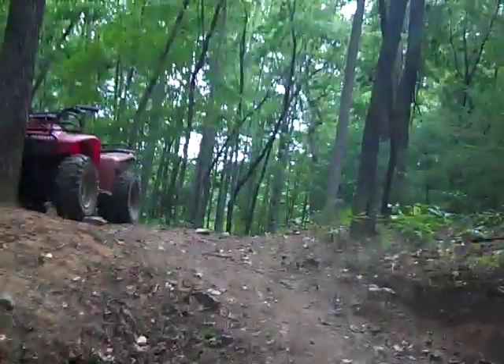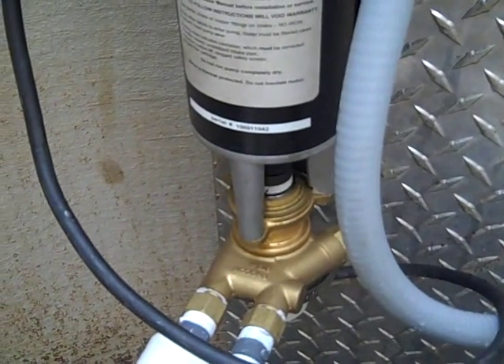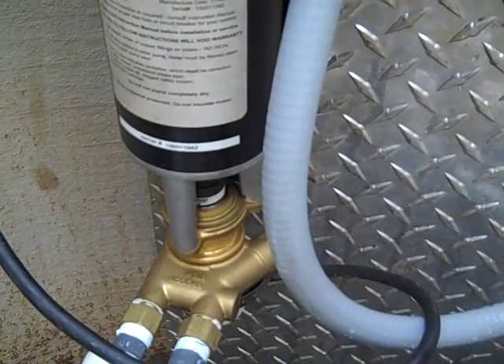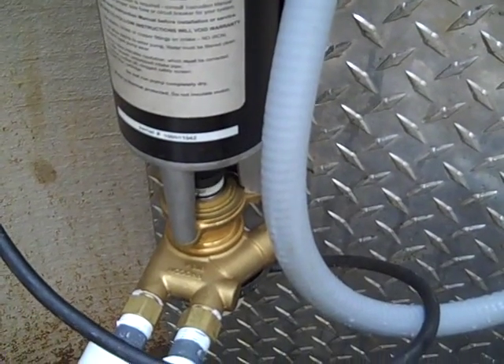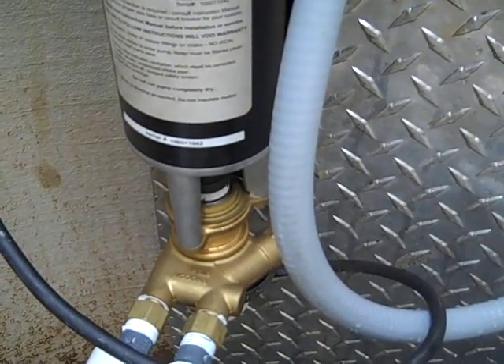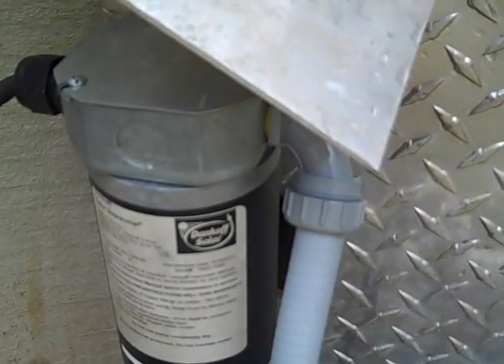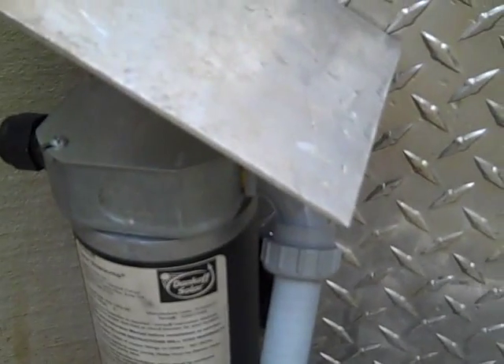We are hooked up. During a thunderstorm, cloudy skies, that pump is still turning off a 24-volt array that's 400 feet away. It's not pumping at full capacity, but that's what the linear current booster does — it keeps the motor turning up to 40% more. The pump is oscillating a bit with the low light. I've put a rain shield over the controls and motor, but even without it, it sheds 99% of water.